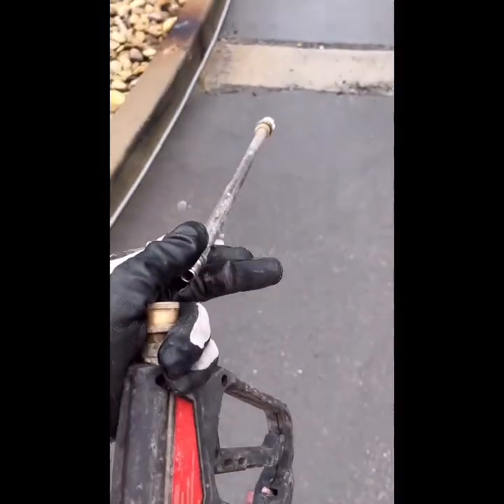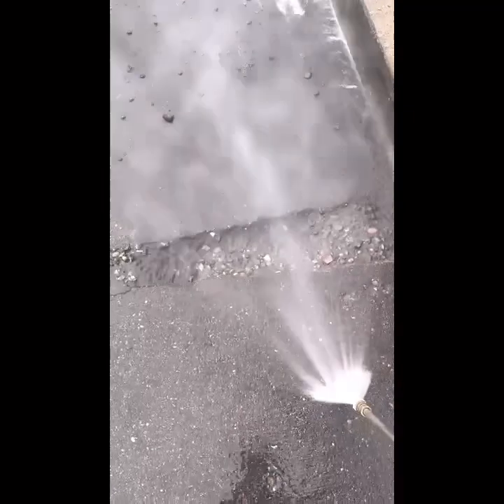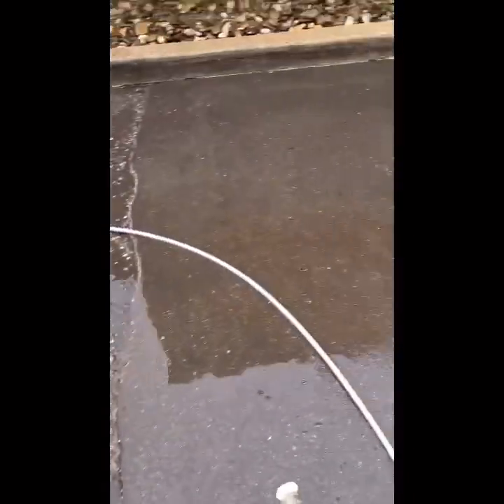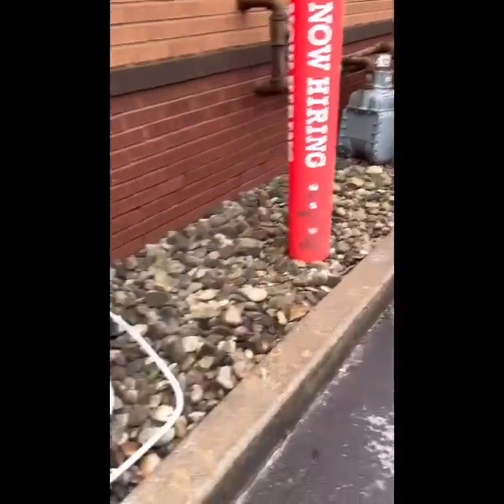I like to use these little extenders on my gun — it just makes it easier for in-and-out stuff. Use a long gun if you're doing a lot of work. With hot water, you just go over the gum like this with a white tip and it comes right off. I'm trying to be careful not to push too much of that loose gravel out of the drive-through. If you don't have hot water yet, rent it. Don't try to half-butt it because you're going to make a bad name for your business. If you're not ready yet, be smart and rent — you need hot water for this stuff.